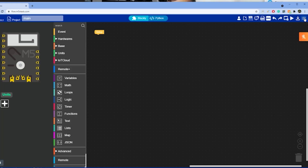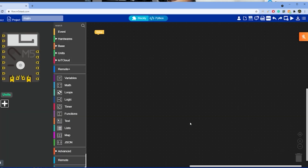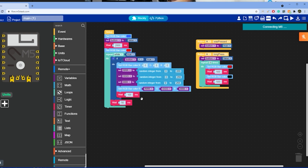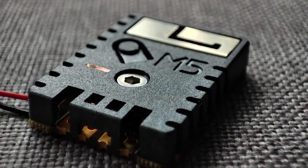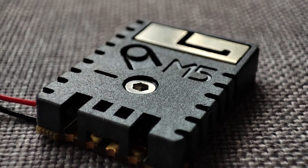Once in your local network, navigate to UI Flow, open settings, select M5 Stamp, and provide your API key so you can access the board. And that's it — you can start programming. It took me like 3 minutes to create this simple sketch in which I can cycle through random RGB colors and stop them with a long press of a button. It's that simple.